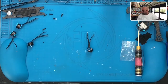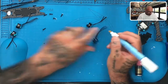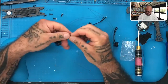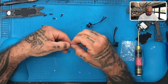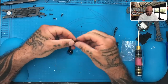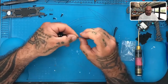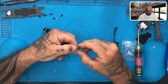So now what we're going to do is tin these up. I'm going to get my flux pen and just lay the wires out on my table and go over them with the flux pen — just kind of get the flux into those strands right there. Now close the flux pen up and take each strand, hold the silicone part, pinch the strands, and spin the silicone part itself. That'll tighten up those strands pretty well. Don't spin the strands — spin the silicone and pinch it on the strands, and the strands will tighten up as best as they can. Do all twelve wires across the four motors.